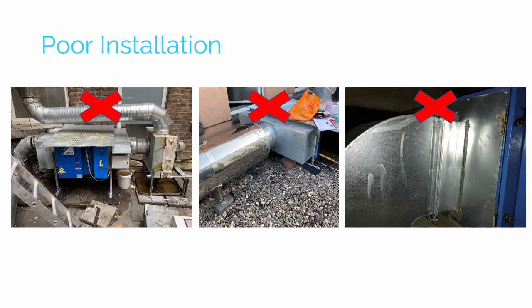These are some examples of poor installations. In all of these examples there is very little transition, and there is definitely scope for the air to jet stream through the ESP. On the third example on the right side, we can see that the ESP is located close to a bend with no transition — just a plate which is connected to the ESP. It's also worth noting that for outdoor installation, the ESP unit is IPX4 rated and may require a weatherproof housing.